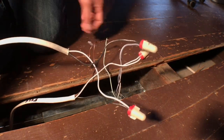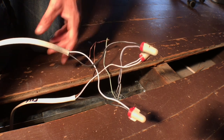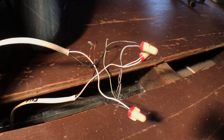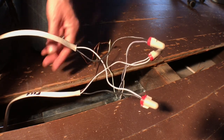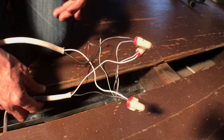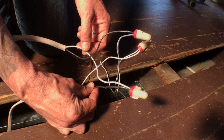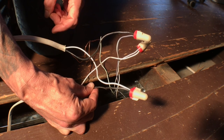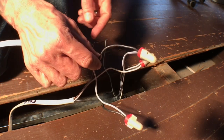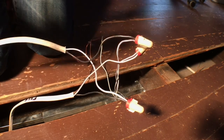Let me walk through the steps one more time. First, green to ground, and wire both Romex grounds together as well — I will cap that before turning power on. After that, connect the white Romex from the feed to the white wire from the ceiling fan. Then, looking at your light switch, you'll notice a black and a white down there. Take the black wire from the switch leg and hook that to the black and light blue of your ceiling fan. Everything grounded — this completes the switch loop.